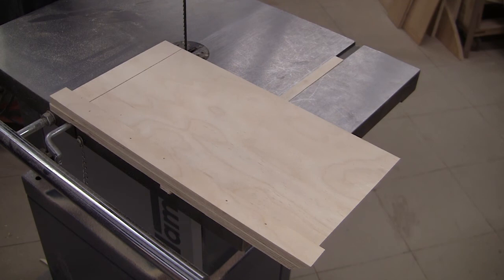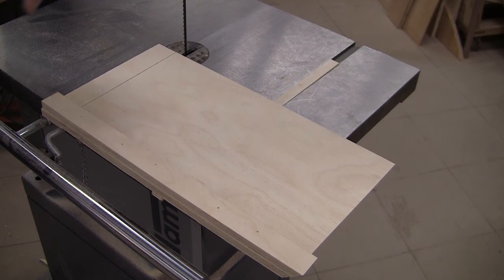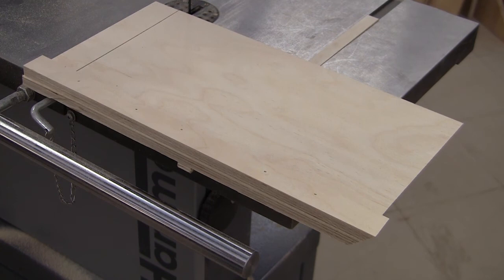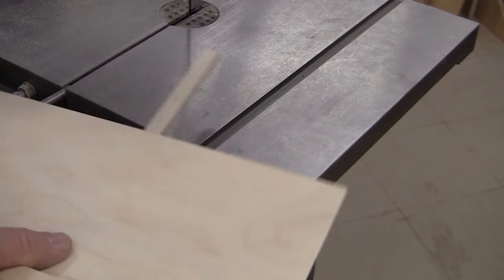I made a strip of wood up that fit into the miter gauge slot on the bandsaw, attached a long sled base to it and a back fence. We use jigs like this throughout the years for cutting edge banding and mitering inlay. I made the base of the sled long enough that not only can I make straight cuts on one end, but if I reverse the jig and tilt the table over to 45 degrees, I can trim and miter inlay.